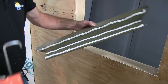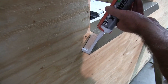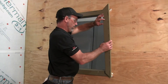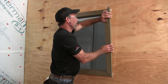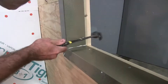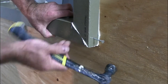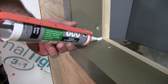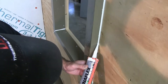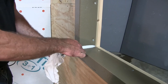After cutting the pieces of Thermal Buck, apply three three-eighths inch beads of DAP Dynaflex 800 sealant to the back of each piece. Install the first piece of Thermal Buck into the opening, then seal the ends and install the next piece. After all pieces are installed, align the corners, firmly push Thermal Buck into the rough opening, and drive an inch and a half roofing nail through the tongue every ten to twelve inches. Check all transitions for sealant ooze out, add sealant where needed, forcing it into the gaps, and smooth all excess sealant at all transitions.